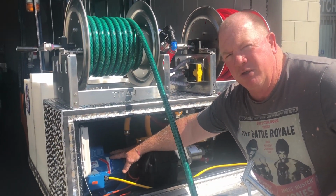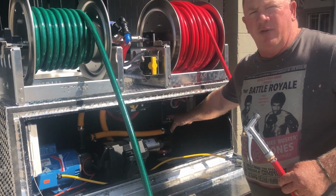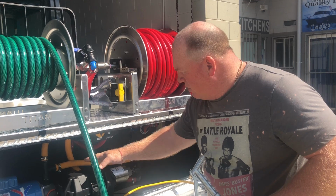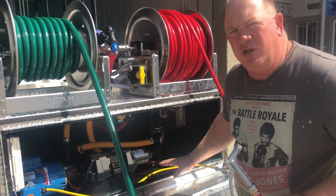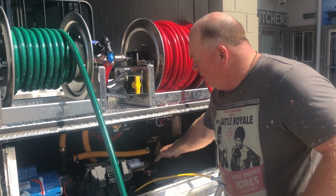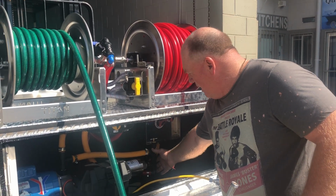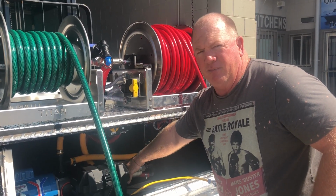The 240 volt booster, 1 horsepower Gould 19 stage, with the recirculation kit on there allows it to run in a stalled, dead-ended position for a few minutes, and then we just pulse and discharge to allow that water that may be starting to warm up to circulate as the recirculation system happens. If we discharge that whilst it's running, we let that little bit of warm water out, and a bit of cooler water or solution will come in, and that'll give you the protection that you need, because the last thing we want to see is these getting really hot and wanting to blow out, and it's just not good for the pump generally.